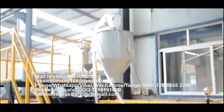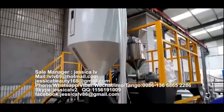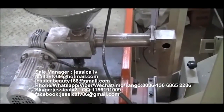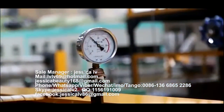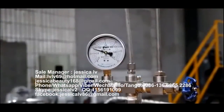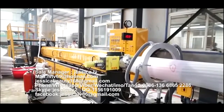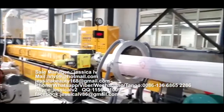The talc powder is fed into the unloading equipment through the Italy double screw, and then enters into the screw to plasticize. The anti-shrinking agent is injected into the spiral tube by GMS pump to mix with the raw materials, preventing the product from shrinking. The liquid butane is injected into the screw tube through the high-pressure butane pump to foam.